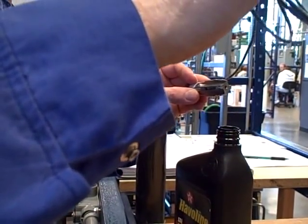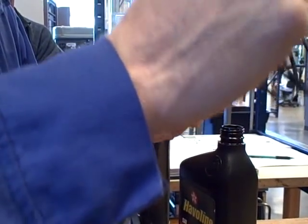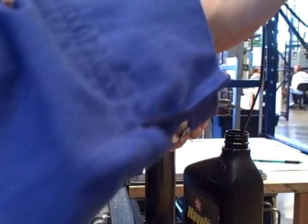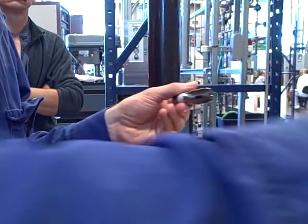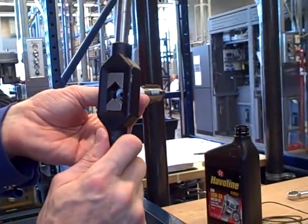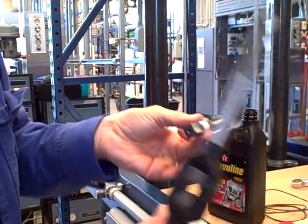The right tool for the right job — using this old piece of wire as a wick. Then what I'm going to do is hand-thread this tap into place and put the tap wrench on top. The tap wrench fits over the tap, grips on it, and allows you to get a lot of torque to turn it.